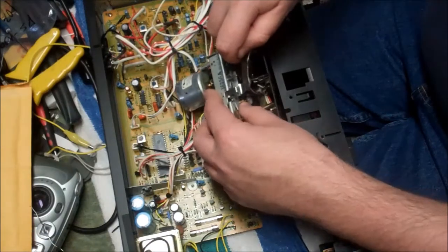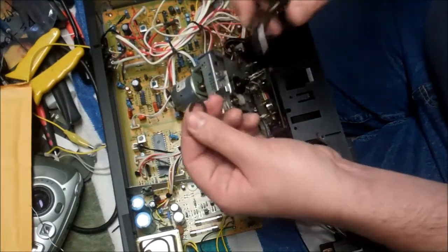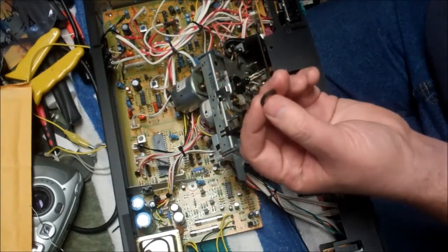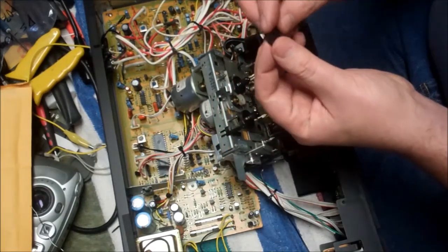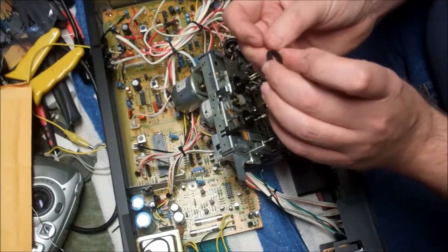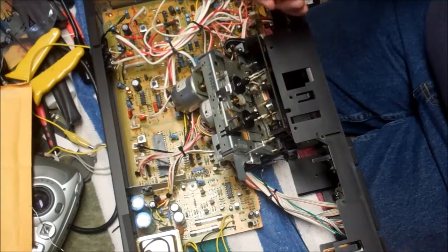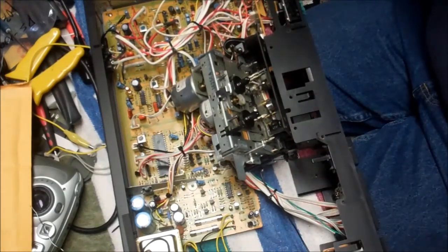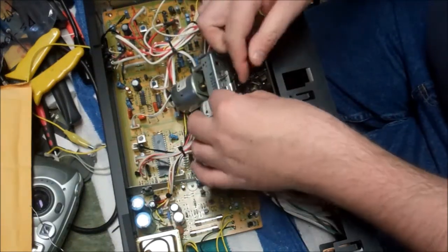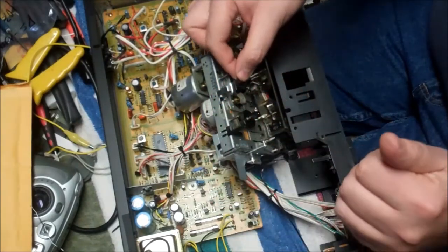Okay, so after a few tries with a sort of funky angled needle nose plier, we were able to get the idler wheel off. I bit it up a little bit, but we're replacing it anyway. So we'll compare that to the original part, and I can see that probably a millimeter or so of that is worn, and this rubber has gotten hardened. It does not appear that there was any adhesive in there, so it should just be a friction fit, and I'm going to try to put the replacement on using minimal tools as to not mar it. We'll try to do this with our fingers.